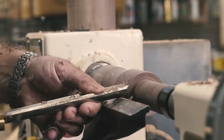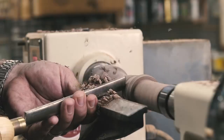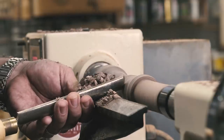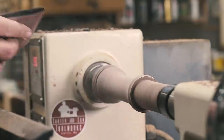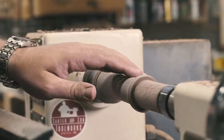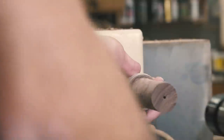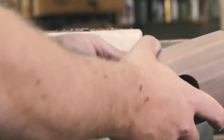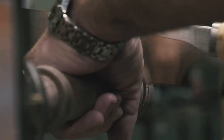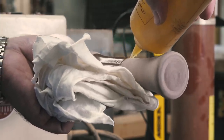With the head shaped, the mortise and tenons cut and fitted, the next step was to finish shaping the handle. I used the roughing gouge to shape the part your hand goes around until it felt good in my hand. I've got large hands so I made my handle with a little more girth — this is the part why making your own tools is so great. You can custom-tailor the fit to what feels comfortable for you. I sanded the handle then mounted the tenon in a four-jaw chuck to cut the bottom off and finish with some Mahoney's walnut oil.